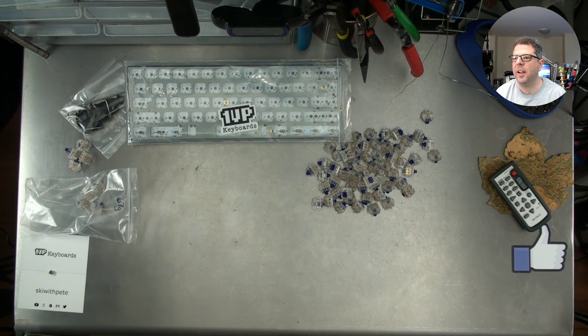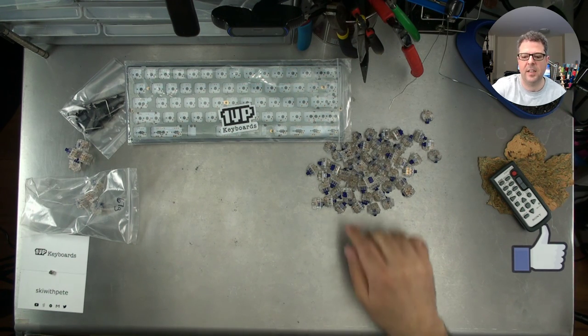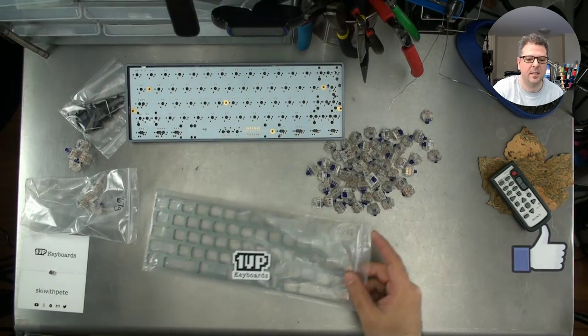How do you suggest trying to fix stabilizer wires that have come out of the bracket on the board? I'm trying it with a bent pick, and it's tough. It is tough. I've been down that road. I talked to JB1830. He's been down that road a bunch too. You know what I use sometimes is a flathead screwdriver, just to push in there.